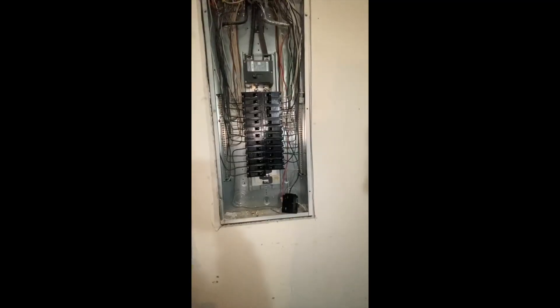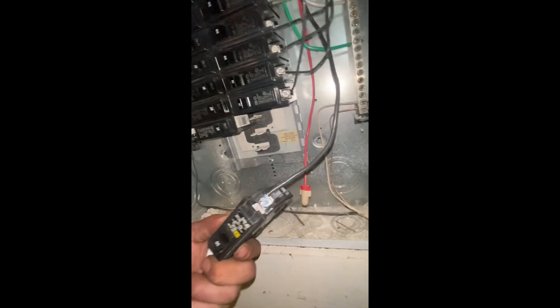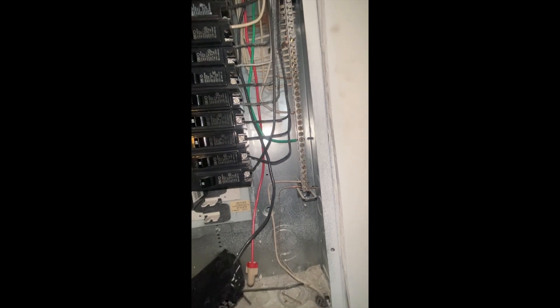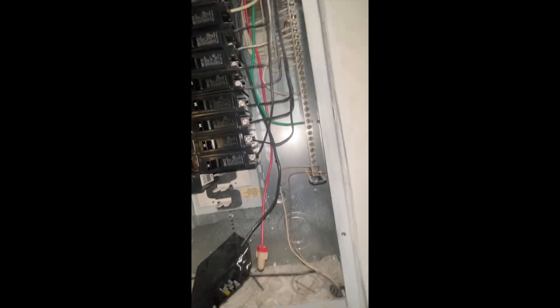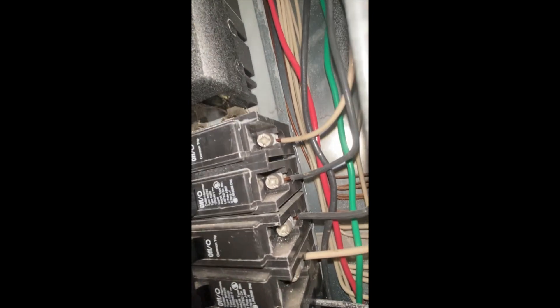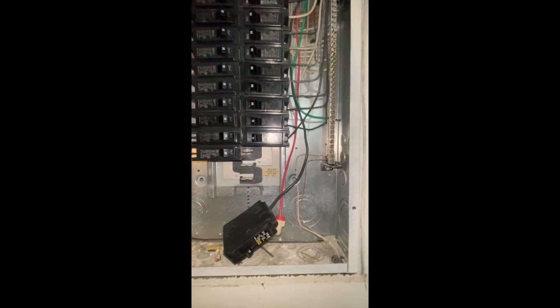Here's my panel — I just want to show you guys. I had a 30-amp fuse sitting right there that was for the outlet in my garage. We had the black running to the terminal on the fuse, the green on the neutral bus bar or ground bar, and the white on there as well. I'm going to leave the green as our ground, disconnect that white wire, and get it out of the way — make sure it's not going to arc on anything. You always want to work on the receptacle first and then come to the panel. Basically we're going to run the white and black into the dual 30-amp breaker — black on the bottom, white on top — plug the breaker in and we'll be good to go.